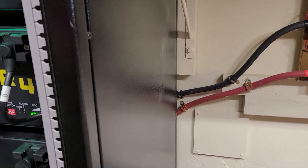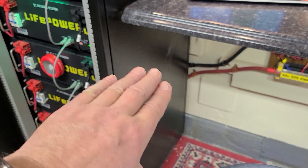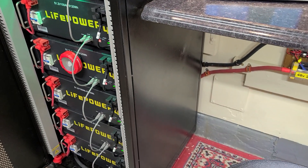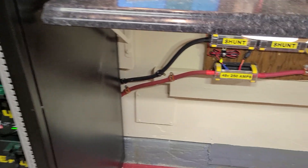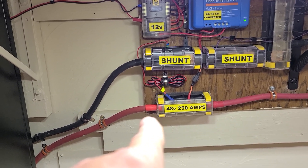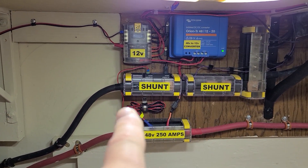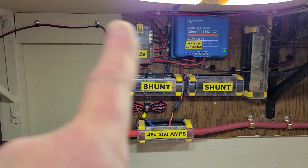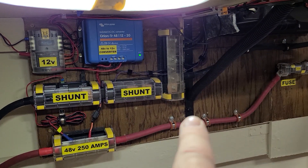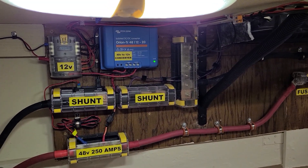On the back side, I did the same thing with cable relief. Now I have three black and three red attached to the cabinet there, so when you're pushing this around or sliding it off to the side, you're not going to yank cables out — a little additional safety on there. And down here, I replaced that end with a new lug end and new marine grade adhesive heat shrink. Added a second shunt with that Victron Smart Shunt, which is actually working pretty good. Cleaned up some wires, painted this bracket right here, and added a little black split wire loom right there, so when you're using your wrench you don't make contact with metal.